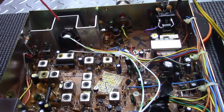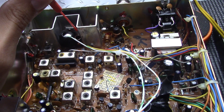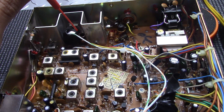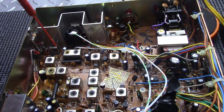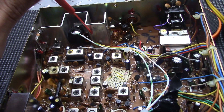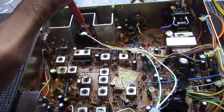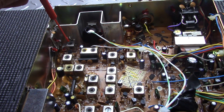And guys, that's pretty much it — you're done. Final in, bias circuit in, remove C61, remove R55, put your cap in there, you're done. Now that's as far as installing and removing parts. You're not fully done in the fact that you do have to retune everything. This tuning slug right here is already removed on this used radio — I would normally keep that in and just retune it for where I need it.